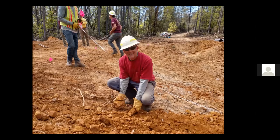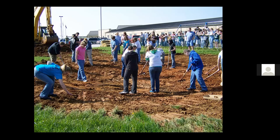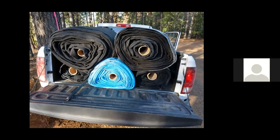Once the basin is dug to the correct elevation and shape, all rocks are removed by hand — we don't want any sharp rocks under the liner. It takes a lot of people to remove these rocks. Here we're using students at a school to rake the bottom and remove sharp rocks and pieces of glass. The liners we use are aquatic safe and fish grade — they must be safe for drinking water. All liners used for roofs are treated with chemicals; if you use them to build a wetland, they will kill aquatic life. You must ensure you are using a fish grade liner that is aquatic safe.